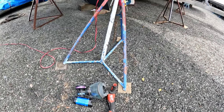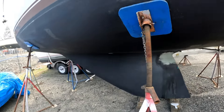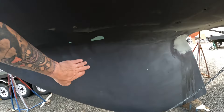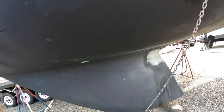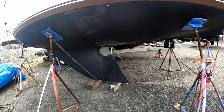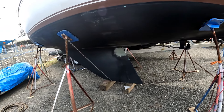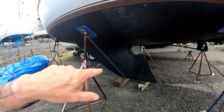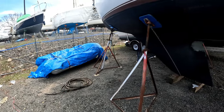All right, we are now with Artemis and I'm using this to get her ready for paint, which will be taking place tomorrow. This is my fault — especially in this crotch area, I did not sand well enough and the ablative paint has now fallen. We need to get that all off so I can put my non-ablative paint on. I'm just going to do some touch-ups. Jason's going to go ahead and film while I do this, and since we're talking paint, I'm going to paint my numbers on the hull.